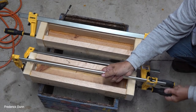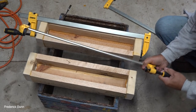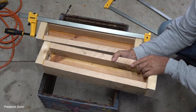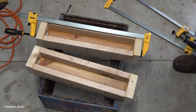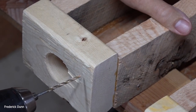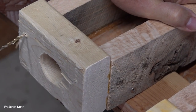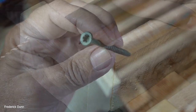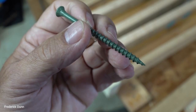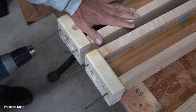It's been a couple of hours. The end pieces are on — take the clamps off, then drill out and put in deck screws. These are heavy deck screws over three inches long, self-tapping with a cutting leading edge, and they come with their own bit for your drill. The pine of the two-by-four isn't a problem, but we pre-drill near the ends to avoid splitting.